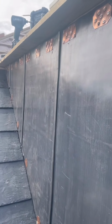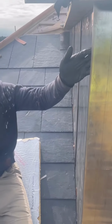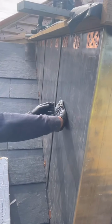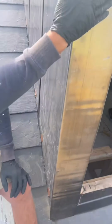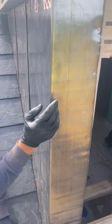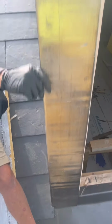You see, the rest of that's now been bossed into position, and that's the cheek done. You would normally, again unfortunately, I've said that a lot today, you'd normally pull the welt away from the large end every time, so you're always pulling away from the welt. But due to the fact there's timber going down the front and we don't know exactly how wide the timber's going to cover, we didn't want to pull this welt around the front and risk jeopardising anyone's timber work.